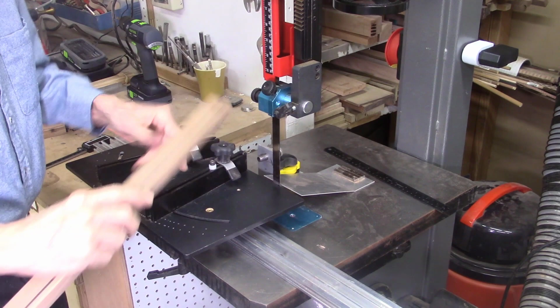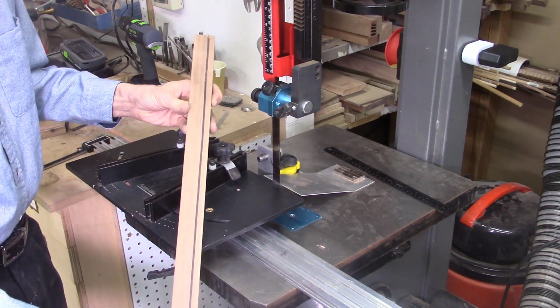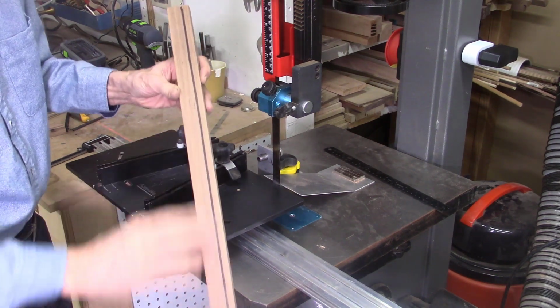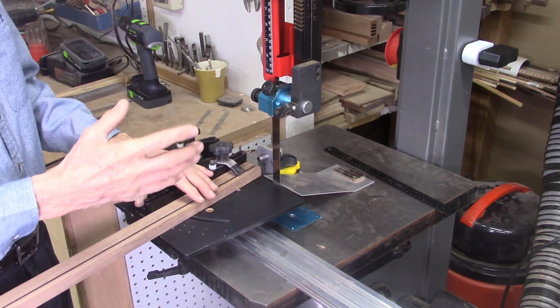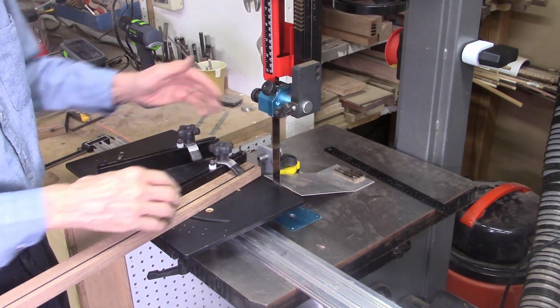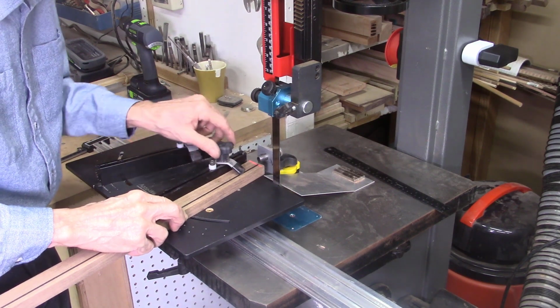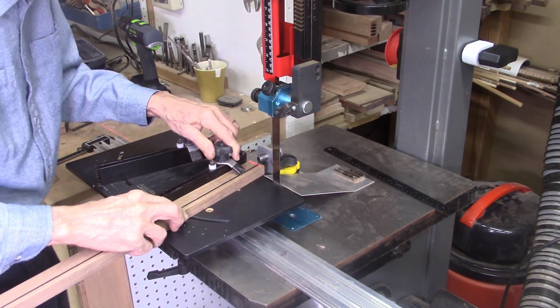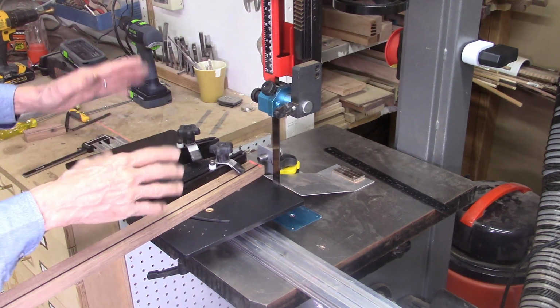Okay, I have some boards here, and I put my offset line down the one line on the edge, as I always do to keep these aligned properly. And now I want to make a disc that's going to be 4 1/4 inches in diameter. So I know my width of my disc needs to be 0.75 inches. So let me do my first cut to give me an edge. And I have it set to 18 segments per wedge, so I'll be doing an 18 segment disc.